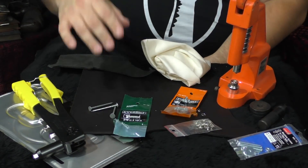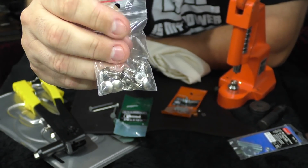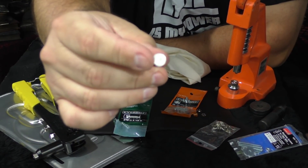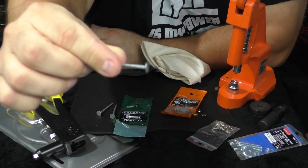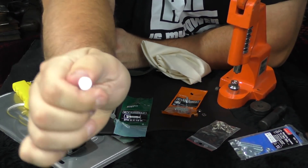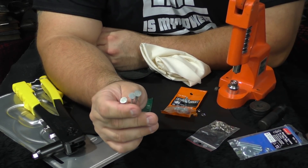If you're not using nuts and bolts, you could go old-fashioned and use actual rivets. You can buy rivets that just basically snap together — you just push one into the other and they snap or tap into place with a hammer. You can also make your own rivets using nails: find a nail with a decent-sized head, cut it off at the right depth for the two items you're putting together, put it through the items, snip it, and then hammer the end until it is flat. It's probably the most realistic approach but also the most time-consuming.